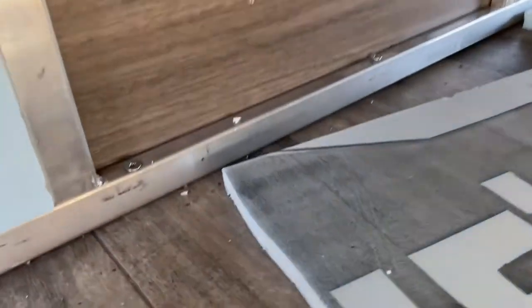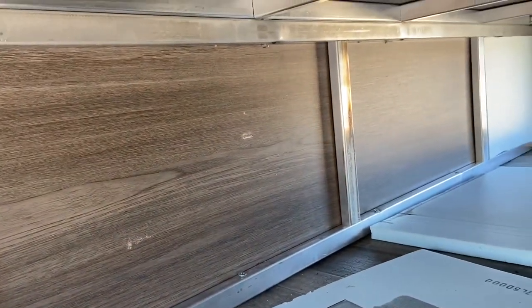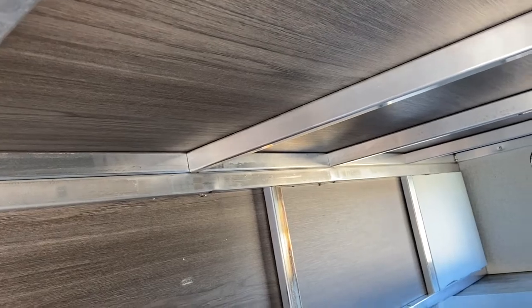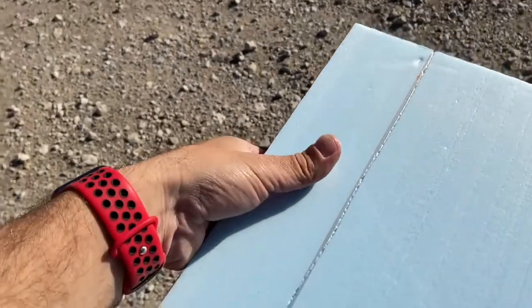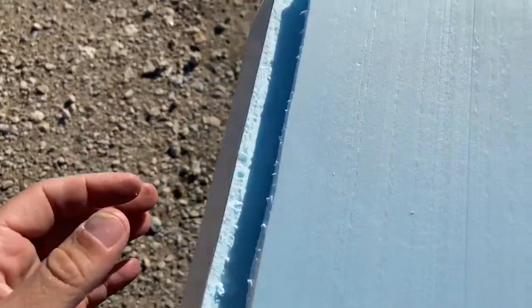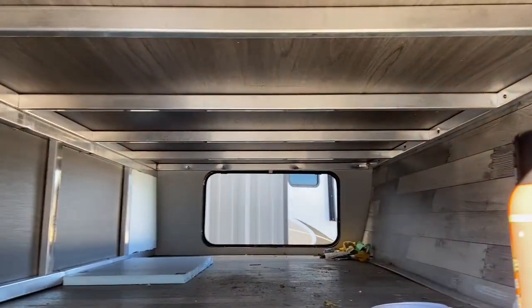Got all these cut out. Now it's time for the ceiling pieces. I found out if you go a little bit shorter — especially here where the screws kind of got in the way — you avoid a lot of trimming. So I'm going to go automatically about an eighth of an inch shorter up through here. One thing I didn't realize until doing the top part: since it's styrofoam, after you do a slice maybe halfway through, all you have to do is pop it. You don't have to cut all the way down — just push on one end and it snaps clean.